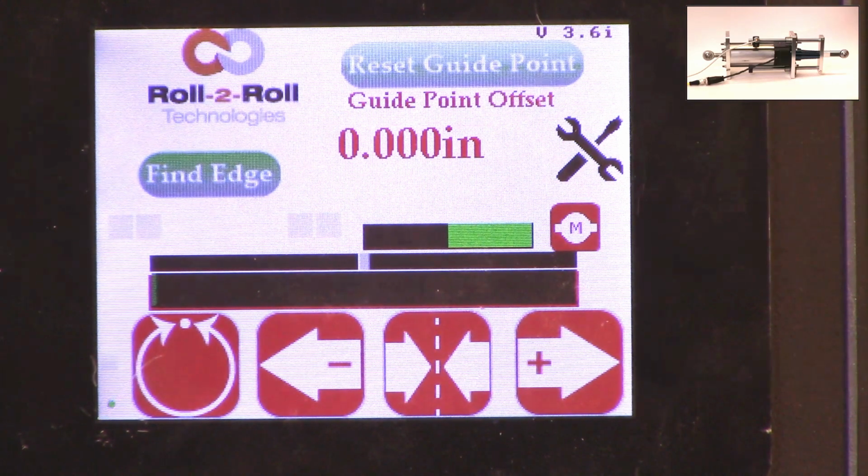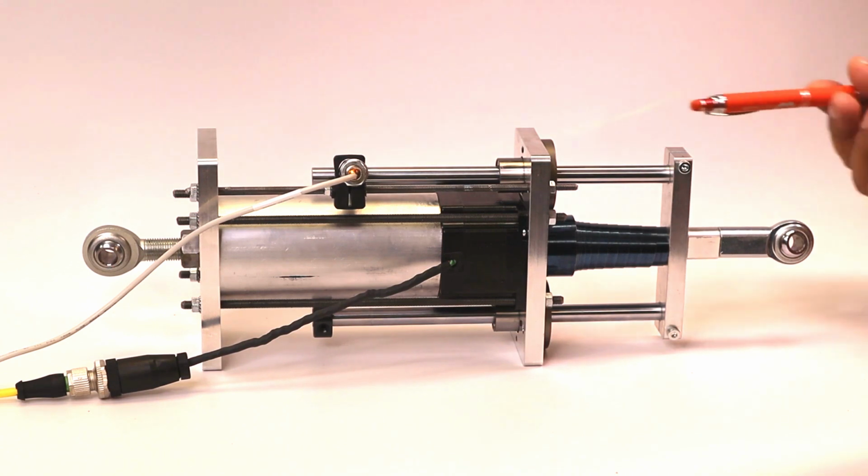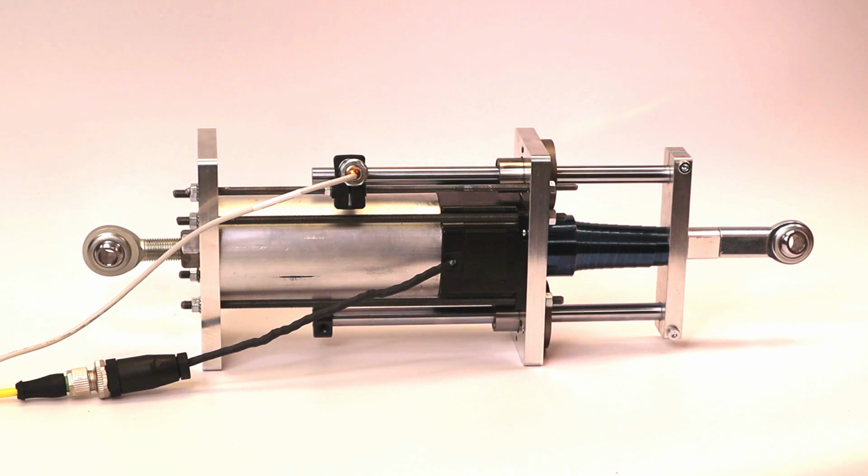We're going to see how to set the stroke of the actuator, the pitch of the actuator, the speed, the polarity, and so on and so forth. We do have one of our actuators connected right now to the SCU5 controller, and that's the one right here. This is our standard upgrade kit actuator, and it has a front spherical eye and a rear spherical eye, and bearings supporting the actuator to extend and retract. And this is our LHS series with a 4-inch stroke.